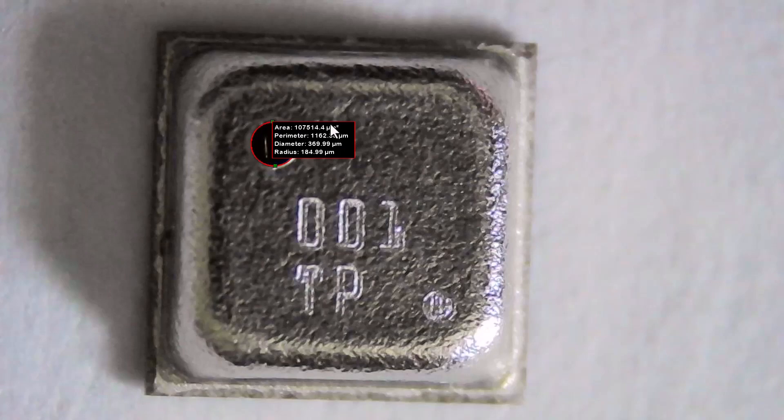The way we've split up this episode is: we'll open up the can, look at the underside first, then look at the can and the system on the substrate. We'll split it into two parts - the first part looks at the micro hot plate gas sensor in more detail, and the second part covers the pressure, temperature, and humidity sensors along with the ASIC. Let's now look at the underside and talk about the footprint.